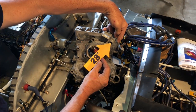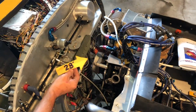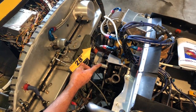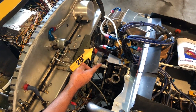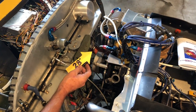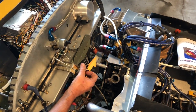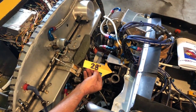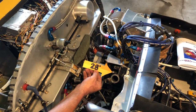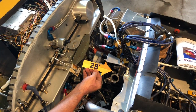Your primary right there — center line of the bolt. Although this engine is equipped with an SPA rear alternator, it does block a little bit of the traditional timing marks. But you don't care so much what the timing is doing at idle. What you care about is when the engine is at its full static RPM, that you have 28 degrees right there as a maximum. Then you're going to check the B side, and the B side can be 28 or slightly less.